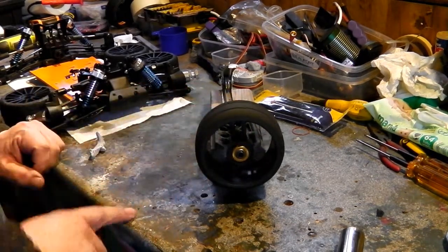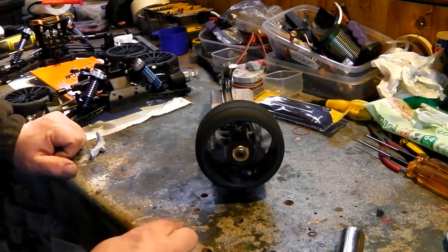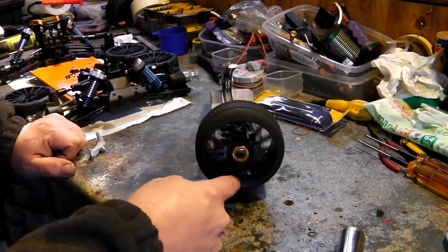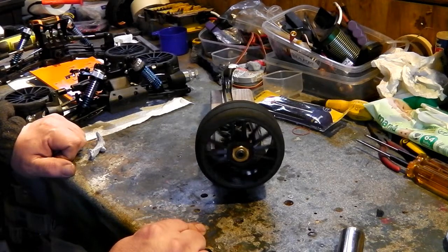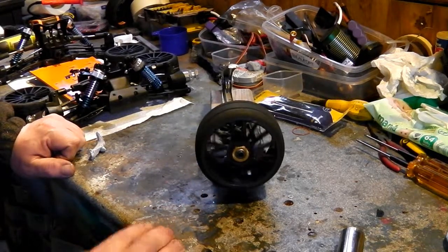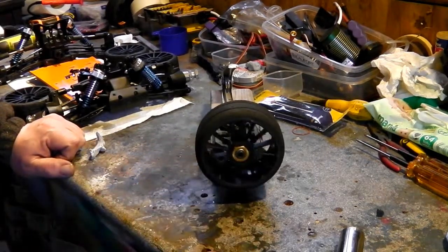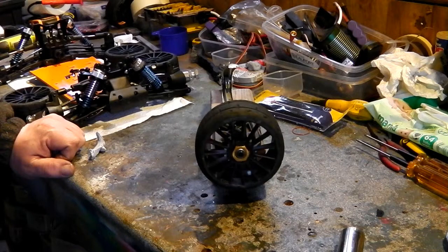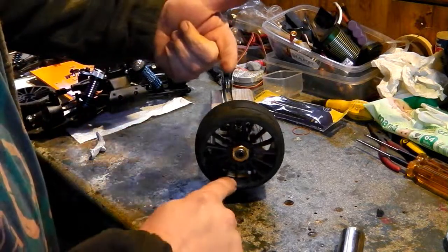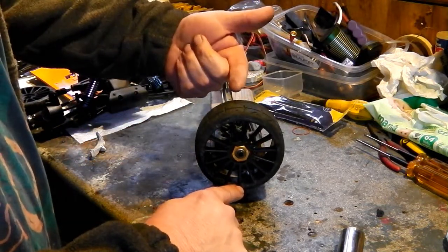So now the idea is, if it's unbalanced, it'll get to its heaviest point and start swinging. Okay, which is probably going to happen right now. Sometimes you have to just do it and check it, because sometimes it's quite subtle. But I know, there you go. So, how do we balance it? So we need some weight. As it's heaviest here, we need some weight dead opposite.